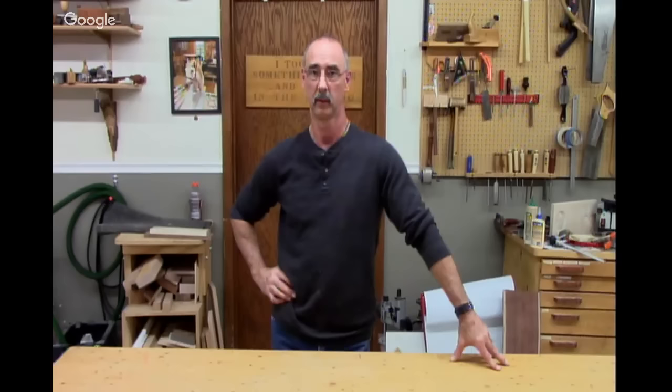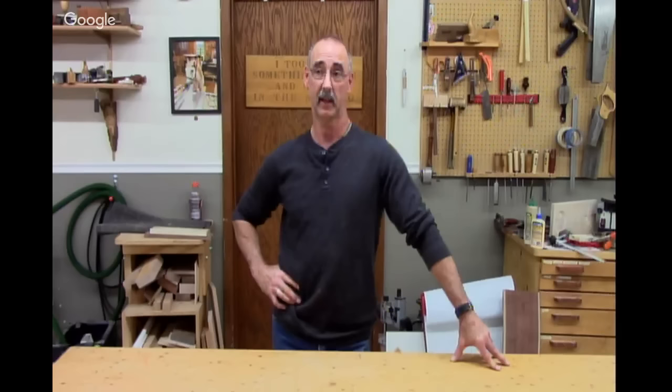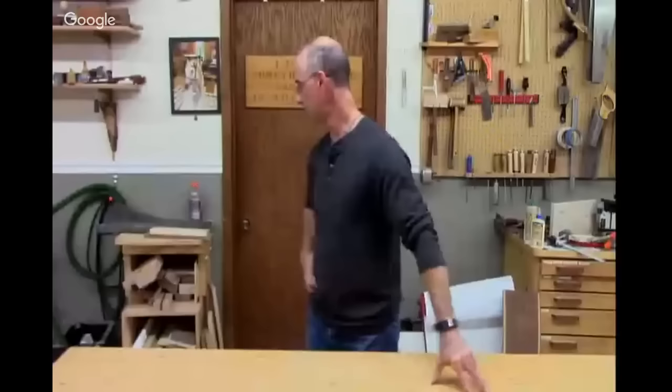Wayne is getting wedging in his wood taken over by the jointer. He tries to use sharp knives, which seems to help, and has made the infeed and outfeed tables as coplanar as he can. Any suggestions for what might be causing this problem? I wonder if you're edge jointing or face jointing, Wayne. Most commonly if you're not getting a straight edge it's because the outfeed table is in the wrong position. Let's head for the jointer.